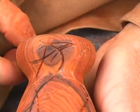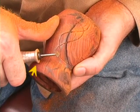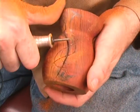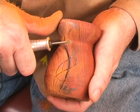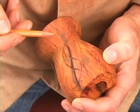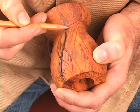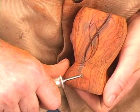These overlapping lines help to create a visual focal point. If your handpiece seems to be getting in the way when making acute cuts on the inside of coves, try flipping the piece around and attacking it from a different angle. You'll notice that the handpiece has nothing to bump up against, and you can swing the cutter through a smooth arc, cutting a fluid line. The weight of this carving feels a little bottom heavy, so don't be afraid to experiment by penciling new designs on top of your carvings to see how it will work. That looks like an improvement, so I think I'll carve that right in.